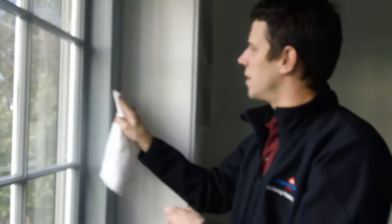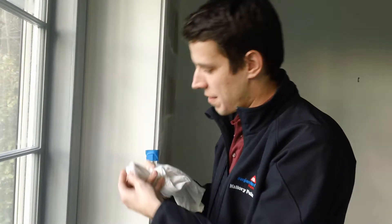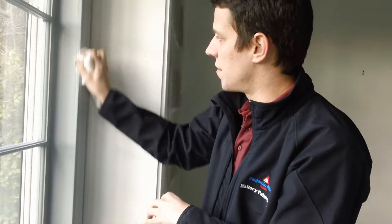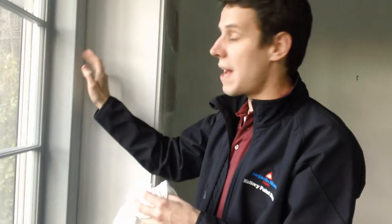You can see at this point the denatured alcohol is not affecting the paint at all, which lets us know that it is an oil paint. If it were a latex, the paint would soften, you'd get more drag, and you would feel a tack if you touched it after you rub the denatured alcohol on it.